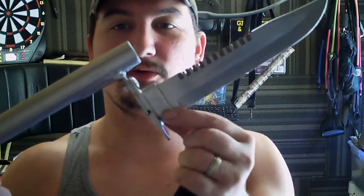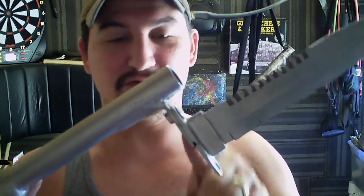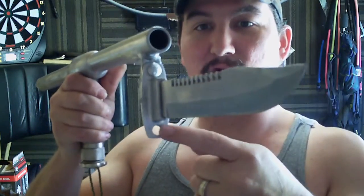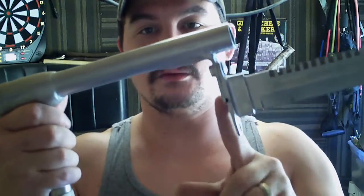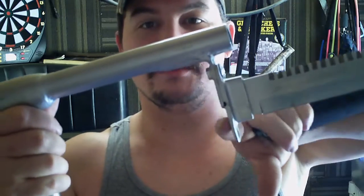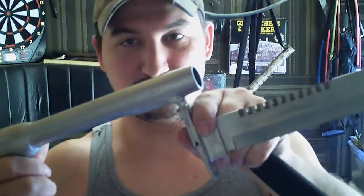The actual handle holder here is made out of aluminum. I could not weld it to the bracket so I drilled a hole through there — there's a hole here and a hole here. The bracket only came about halfway, so I bolted it on there and then JB welded the rest of it, the bracket, to the angle. So it's bolted and JB welded — it's not going to come loose.